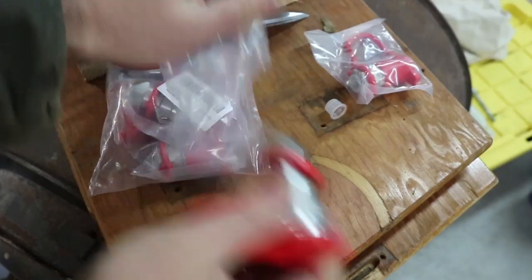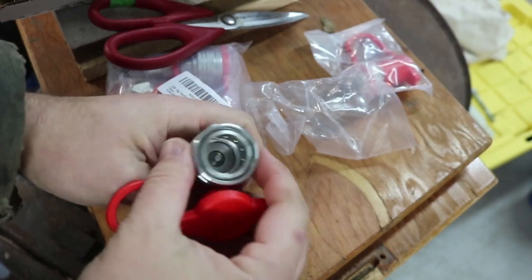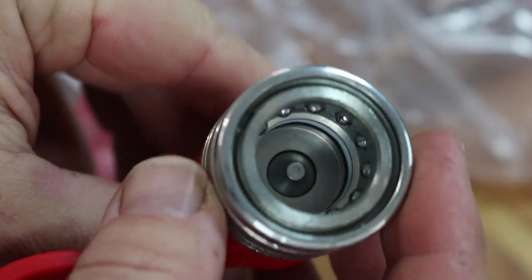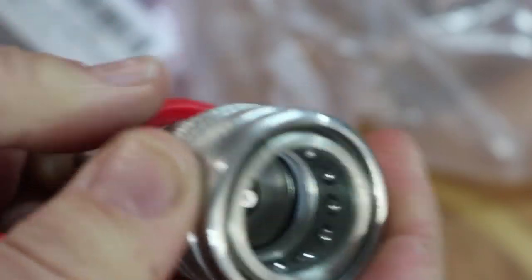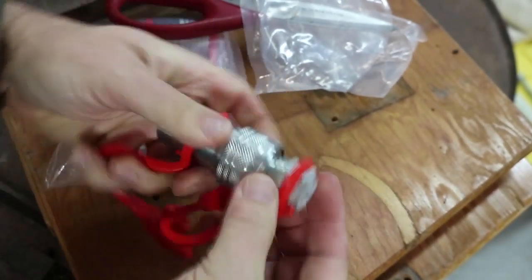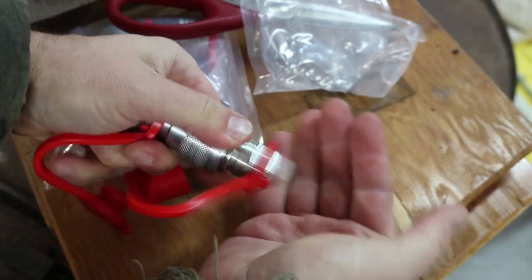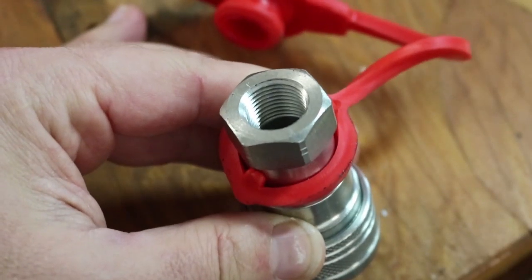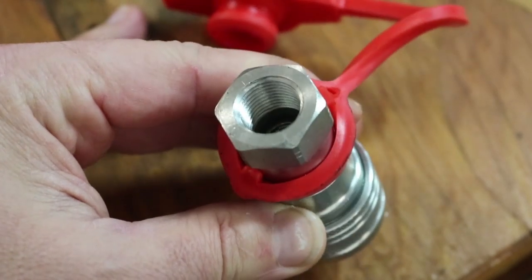This time I'm installing some hydraulic quick disconnects. If you're more familiar with air hose fittings, that's fine as these are pretty similar. Inside are ball bearings that grab the other part and there's a sliding locking collar. There's both a male and female connection — they go together and come apart pretty nice and solid. There's also a rubber cap to keep them clean and covered when disconnected, and the back side of these are three-eighths female national pipe thread to match up with the existing connections.